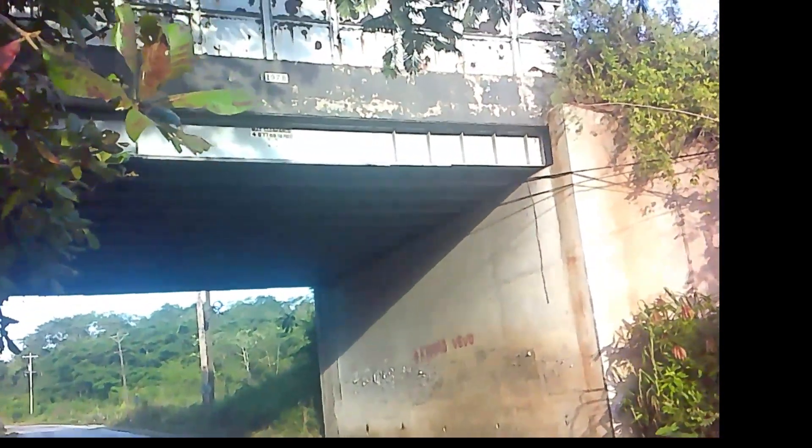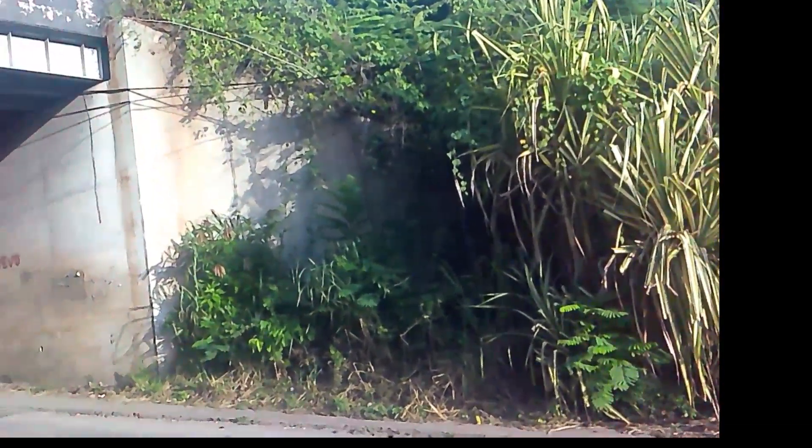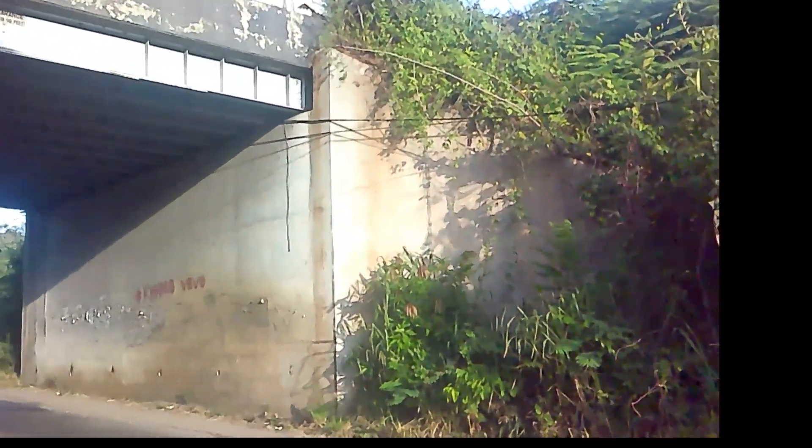This is part of my job back in the States too — I do a lot of bridge inspection. This bridge was built in 1978 and the maximum clearance is 16 feet, 4,877 millimeters. I don't see the load posting for the bridge — it's supposed to carry a posting to tell you the maximum load or maximum weight that is supposed to go over the bridge. This bridge is in pretty good condition in my opinion.